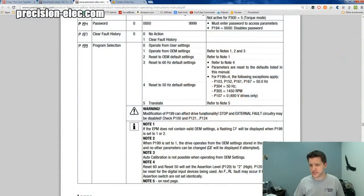And if you are going to wipe out the program and you don't have a backup of it and you need one, try to find a way to pull that program out of the drive. Or in some cases, some people will write down what each parameter is before they do a reset — depends on your situation. Now let's take a look at the manual here first, because this is basically the SM Vector manual, which we have on our website.